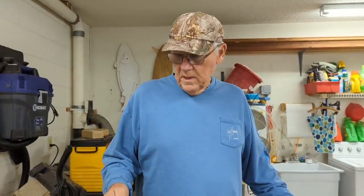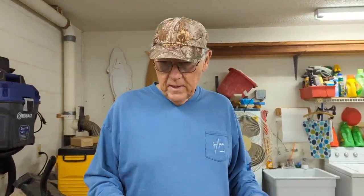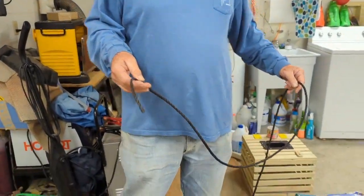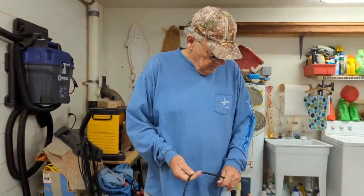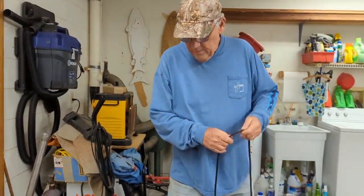What I'm using for the line is 5/16th polypropylene — that's what I had. I had a big spool of it. When you calculate your line, you take the depth of the water and add 20 to 25% to it, and you'll be alright. I put another foot on there because I'm going to splice it on — that takes a little more line than tying it. I usually put the weight about halfway. So this is like 25 feet of line, so I'll put it at 12 feet.